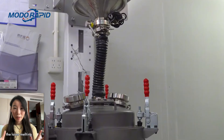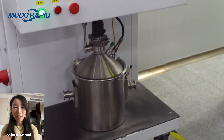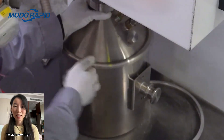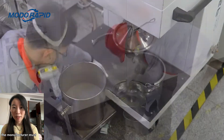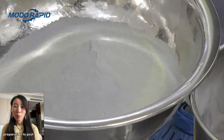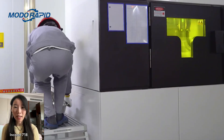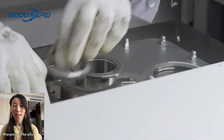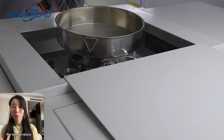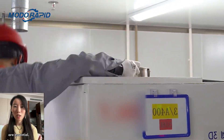During the laser melting process, Inconel 718 tends to warp, crack, or form internal stresses if parameters are not carefully controlled to achieve high-quality results. The manufacturer must understand every stage of the process, from powder preparation to post-machining. Common challenges when 3D printing Inconel 718 include thermal cracking and warping — the alloy's high strength can cause severe residual stress if the temperature gradient is too steep. Proper preheating and scan strategies are essential.